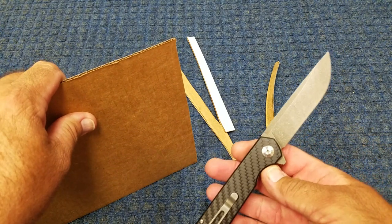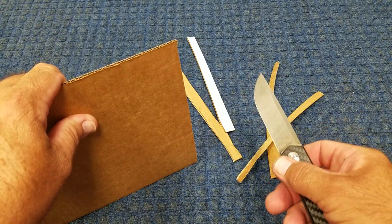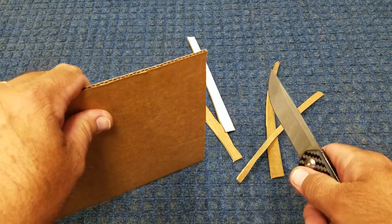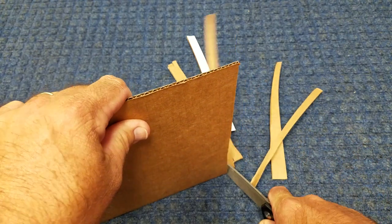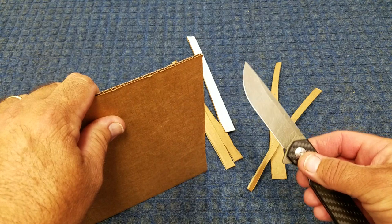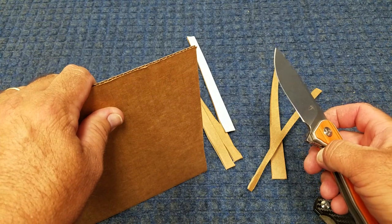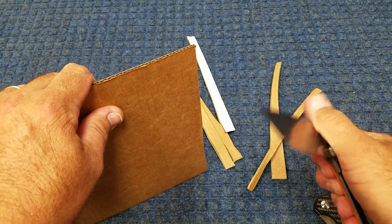Another thing to consider: this FH11 that I put the coating on - it is 0.130 blade stock and 18 thousandths behind the edge. But because the height of the blade is short, it makes a rather quick wedge, so it's not hard to cut with. However, in terms of force required to cut - and this is a pretty fresh edge - this actually takes more force to push through the cardboard than the thicker-stock knife does. Even though this is thicker behind the edge, that knife is less of a wedge going through the cardboard.